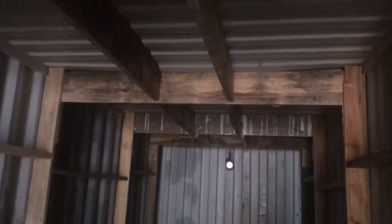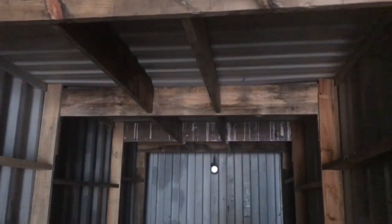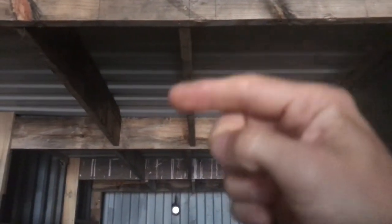Rather than two by sixes, on the deeper end I did two by tens. I had some guys helping me do the framing. We have two by sixes on the sides, two by tens across the top, and then two by tens as well kind of like rafters. Out on the edges it's solid, but this is just support because when I walk around up there the ceiling will actually flex down without support, so I reinforced that more on the part that's going to be underground.